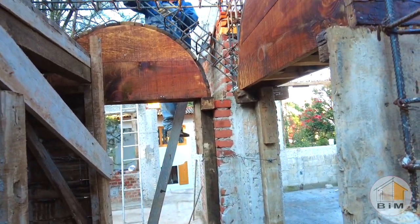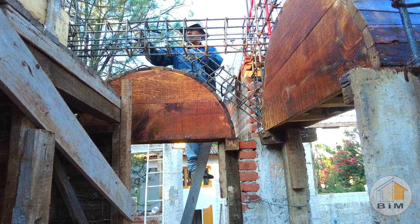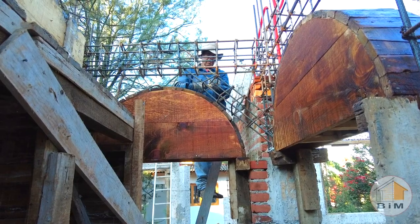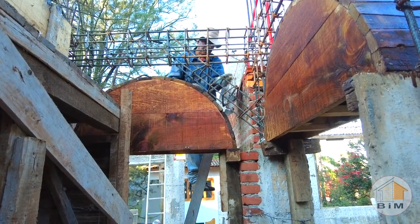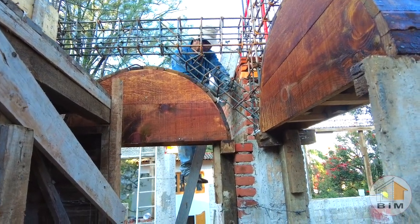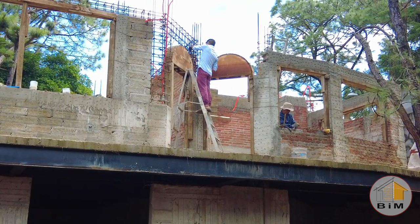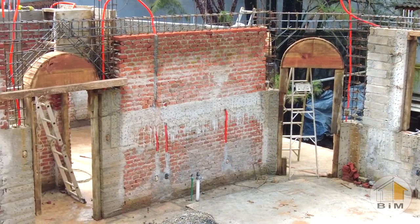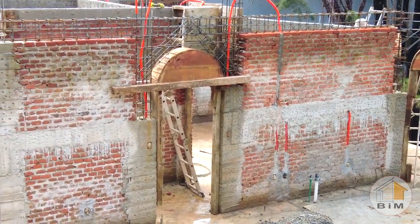And here, Fer is working on the rebar structure. Normally in the doorway, there'd be two uprights and a cross piece over the top, which it still has. But in addition to that, there's a 45 degree angle rebar structure that meets at the top of the arch, forming two triangles set on edge.